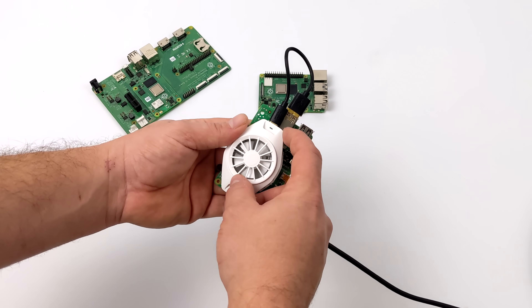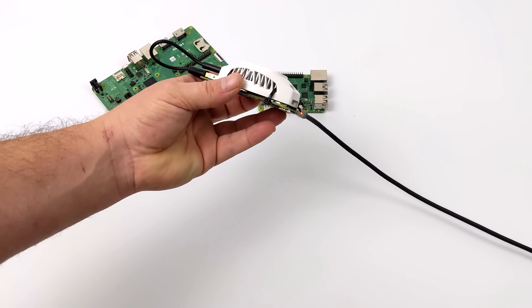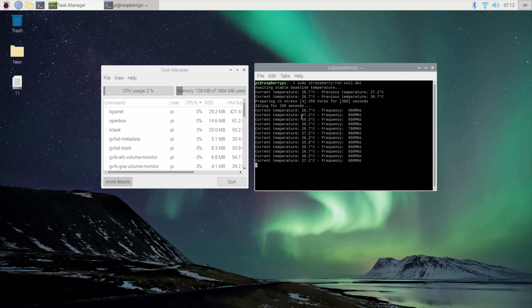Now that I've got everything mounted up, I want to run some tests. We're going to test at stock clocks and overclocked, just to see how well this thermoelectric cooler does with the Raspberry Pi 4. I have this up and running with Raspberry Pi OS, and with the thermoelectric cooler installed, we're sitting at around 26 to 27 degrees Celsius at idle. I personally use Stressberry for stress testing. The Pi is running Raspberry Pi OS on a 2 gigabyte Raspberry Pi 4 at the stock clock of 1.5 gigahertz — I will come back and overclock it to 2.1. Stressberry will automatically plot out a text document, idling for a little while, then maxing out all four cores for 10 minutes to see how hot it gets with the Peltier cooler.